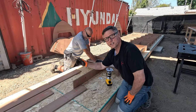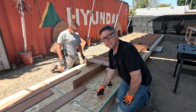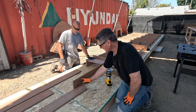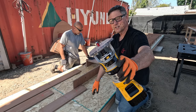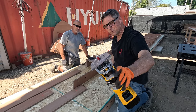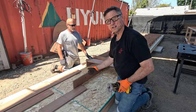These slots are too snug, and on the very first ones we did we had to hammer them with about a 3-pound mallet — about 300 hits — and we broke a couple of the MDFs, so we'll have to do some repairs. That wasn't working, so we figured out that if we got a trim router bit and adjusted it so the roller would go along, we could flip it back and forth and just barely shave a bit off and clean these up. We do it three times and then they slot in there nicely.